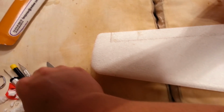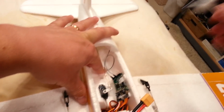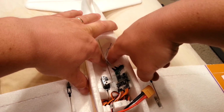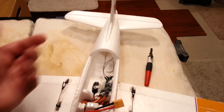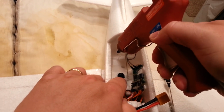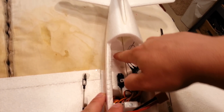This is running a hot drip down there. It's nothing like a good hot drip when you need it. Okay, so now I'm going to take my knife. I'm actually going to spread that hot drip just a little bit. Then I'm going to lick my finger and stick it down in there. Okay? I want to try to get this forced into a 90 degree position, so perpendicular to the last antenna. But I want it to look nice too. Okay? So I think that looks pretty decent. And then I'm actually going to plop just one more drip over here. One little drip. Lick my finger. Push it down in there.